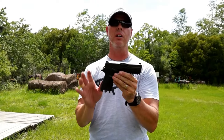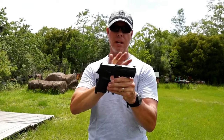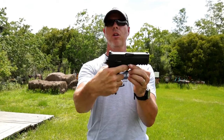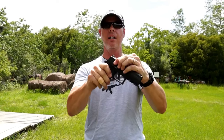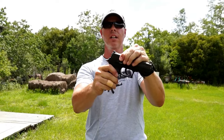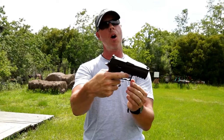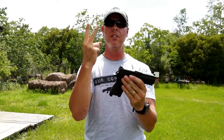This pistol looks similar to a SIG P320 but it is not — the internal characteristics are totally different. This is a double action only. The hammer goes backwards and breaks forward, but there's no way to cock that hammer and keep it there. Even charging the slide like a 1911, this hammer does not stay backwards. It always performs two actions — sending the hammer back and then forward — double action only.